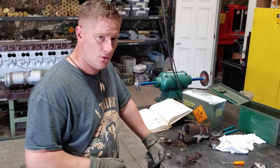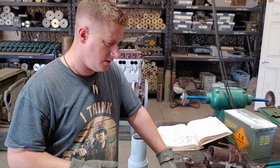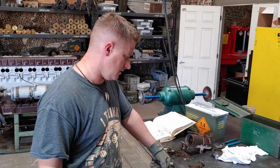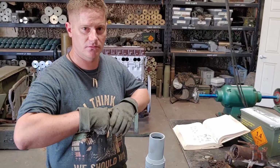One thing to note with these air start tanks, there is an electric starter motor, which you've seen in some of our walkarounds. It's not good to continually start the tank with that electric starter. It even states in the manual, it's for emergency use only. If we continue to just use the electric starter, we'll put so much wear and tear on the engine and the clutch. It's preferable to have the air start system functioning. Plus, the air start's a cool feature of the tank. So it's really the best thing to get it up and running operational. So that's what we're going to do.